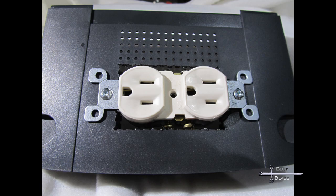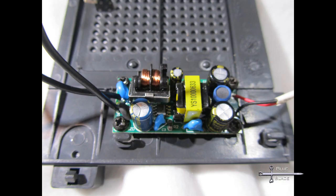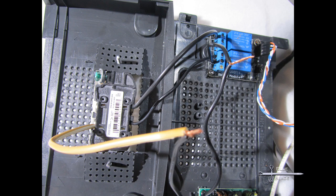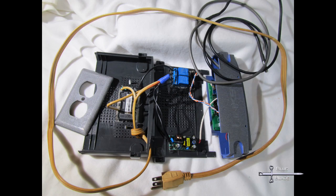The outlet is mounted on the top, and the relays and power supply fit just to the left and right of the outlet, mounted on the bottom. With it all attached to the enclosure, I connect all the components and the power lines, taking particular caution with the AC components — making sure the relays switch the hot line rather than the ground. This is wired nearly identical to the relays and outlets shown in part 5 of my DIY controller series.